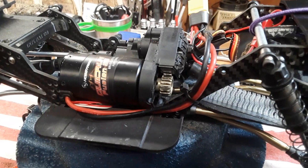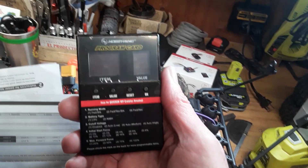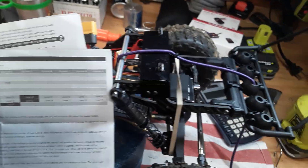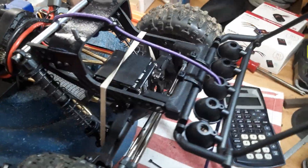A quick note on the Quick Run Fusion SE: to program it, you need your Hobby Wing programmer card from your 1080 ESC. Every time you bought a 1080 you got one of those, so you've probably got about 10 of them - don't throw them away. You do have to get your manual out for the Fusion SE because the numbers on the programmer aren't going to match what's listed, so watch out for that.